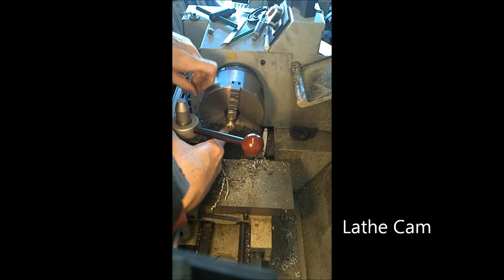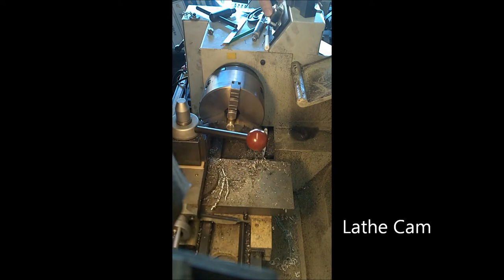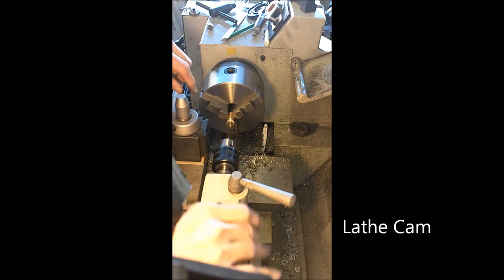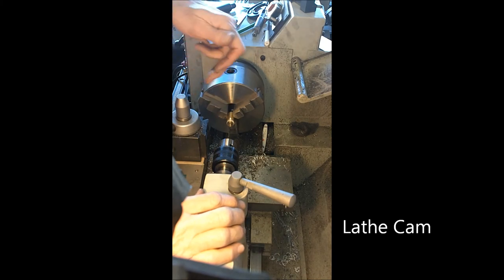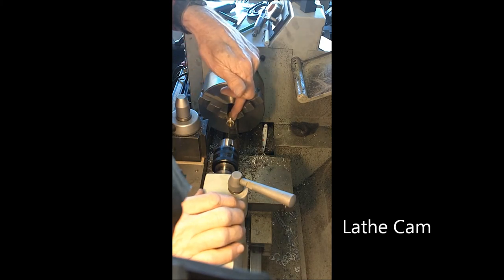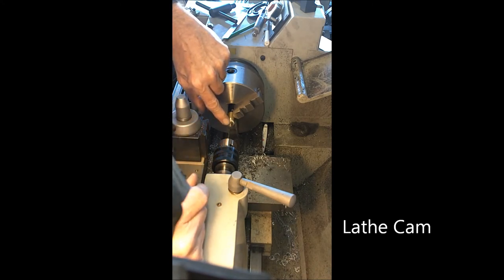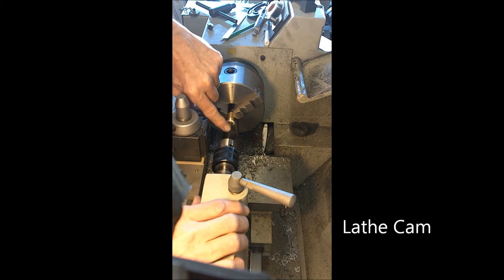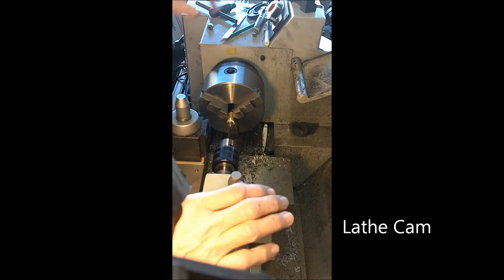Now I need to drill my hole and cut my threads for the piston rod connecting rod. I put my center drill in — just a little pip. I'm going to drill it through at 3/32nds. It attaches to a shoulder in an interesting way. I'll draw a picture of it, but I'm going to drill through at 3/32nds and then come in and counter-drill — I think at 3/16ths, but I'll check the plans. There are three operations: center drill, drill through, and then a little countersink. I'll show you why the countersink in just a moment.